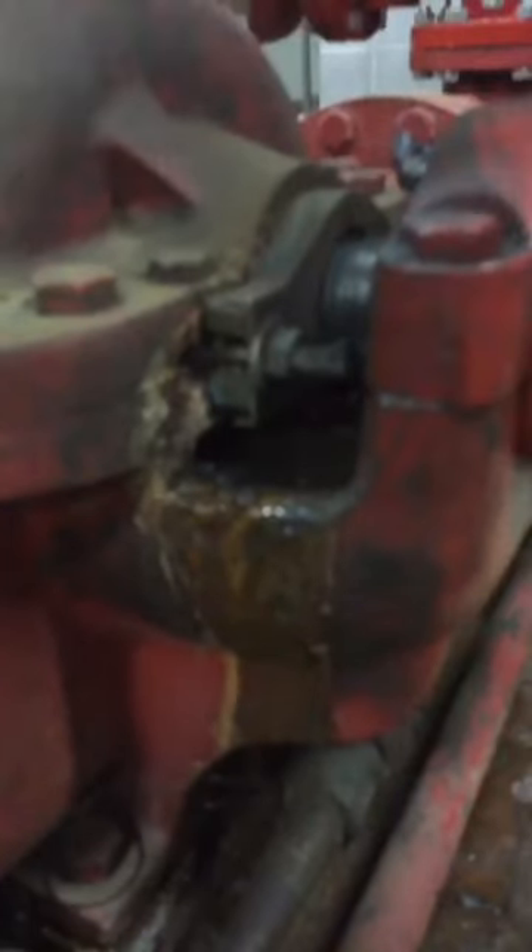When you're doing your monthly check on this — this is an electric fire pump — make sure that your drains are unclogged and the water's actually getting to the drain. Because what this is going to do is decrease the life of the fire pump, because it's dripping all over the concrete base that it sits on, which is affecting how the fire pump is actually connected. So that's going to cause additional corrosion and potentially decrease the life of that fire pump.